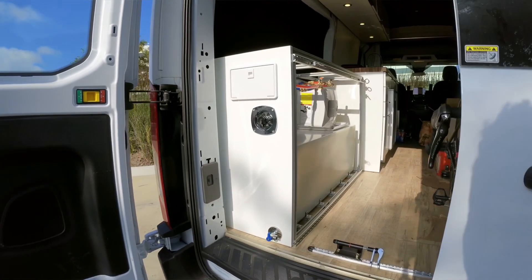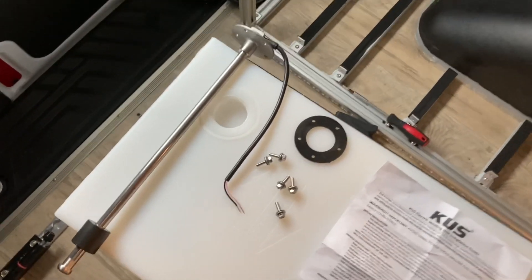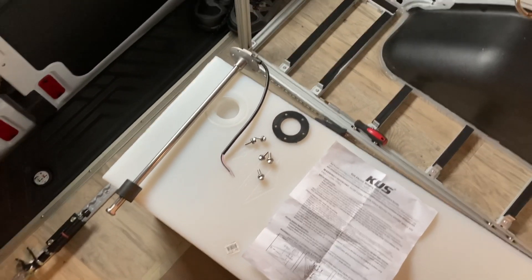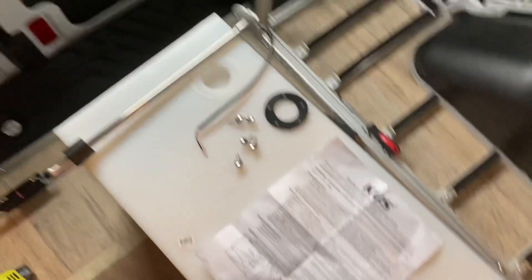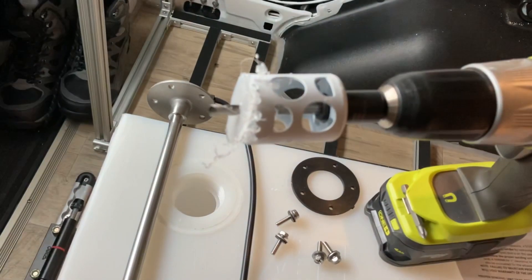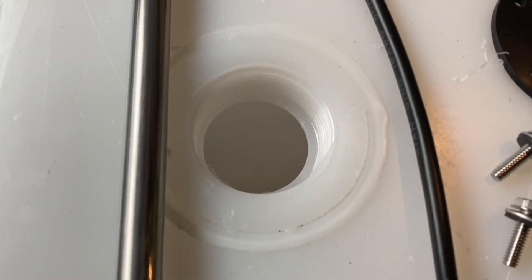Here's a quick high-level overview of the Cuss water meter installation. You're going to need a one-and-a-half inch hole saw to drill out this opening on top of the tank. Do your best to minimize the shavings that come off from drilling the plastic — it's going to be a pain to get all of them out of the tank. You can do this by filling the tank up with water and emptying it out, or you can blow compressed air into it. One way is to fit one of the PEX tubings on a mini vacuum and just suck it all out.